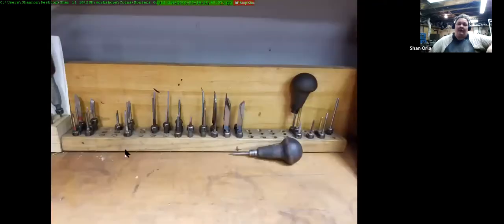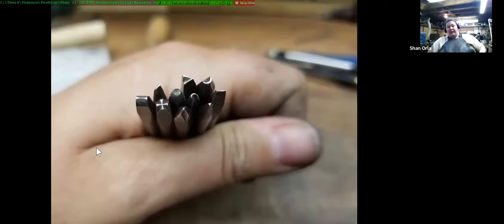That is a square graver. Here are all my gravers — marking tools and burnishing tools over here, and gravers up here. Punches: how do we get letters? Letters are built up of components. If you've done scribal work, you think of an E as a long stick and short sticks with serifs. This set of punches has a couple more than you need — you can make the entire Roman alphabet with about seven punches.